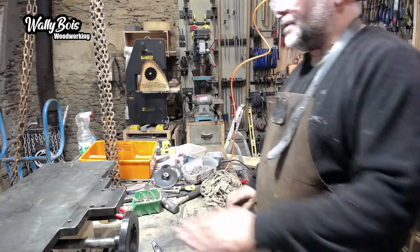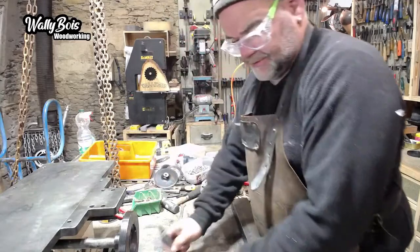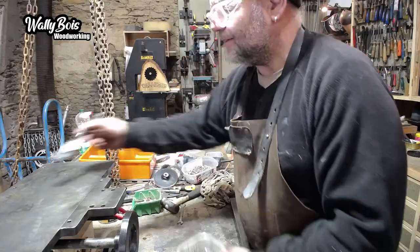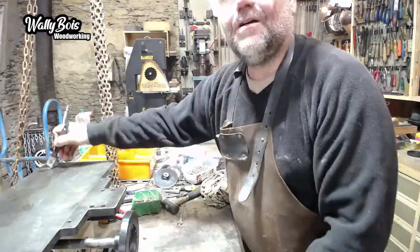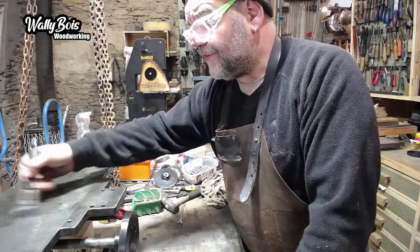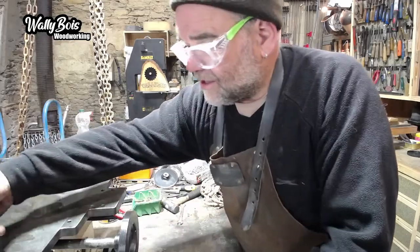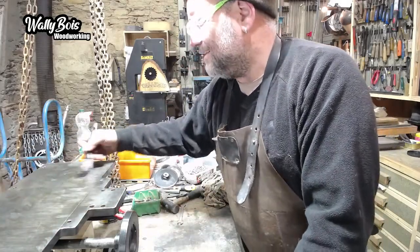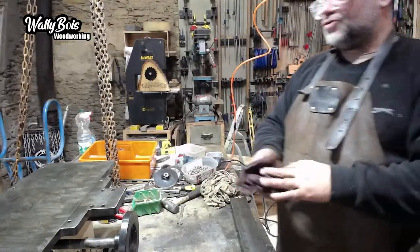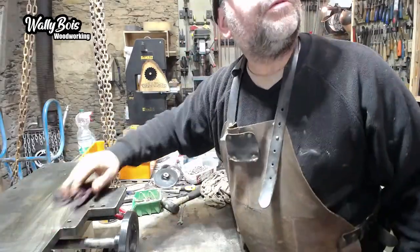Right, well, that's clean there, so that can now be bolted back onto the car. And I'm going to put a bit of oil on there first, I think. Just put a bit of oil and white spirit on there, and leave a little bit of a thin oil residue. The thing is, you see, I work in a relatively damp environment during the winter. So I just want to make sure that if there are any areas that could potentially trap moisture, I don't want them rusting behind. So it's part of what caused part of the problems.